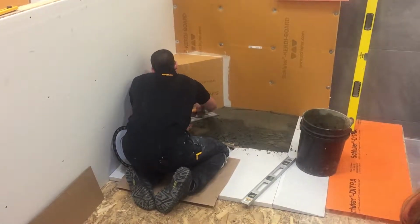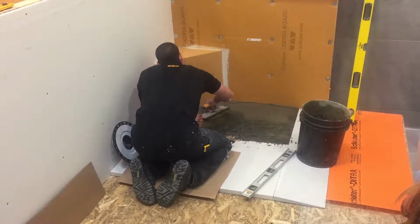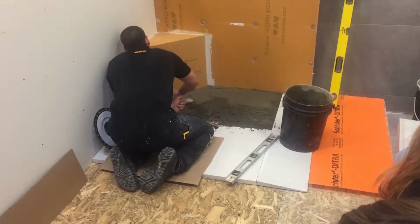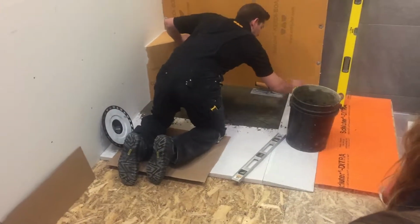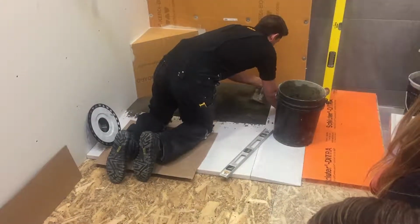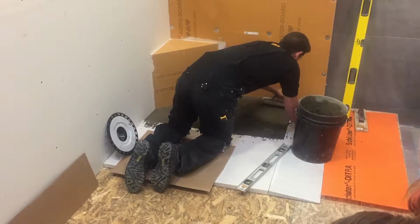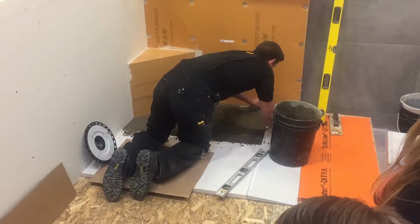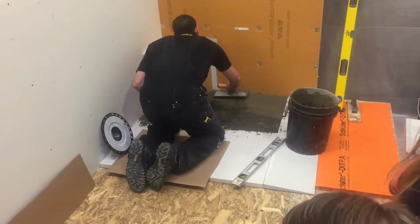Really neat. Use a rotary mixer? Well, there's a few different ways that you can do it. I've seen guys do rototillers. I've seen guys mix it in a bucket like this with a mixer. Not a great method to do that. I'd rather them do a hoe inside of a box. A hoe and a shovel actually works really good. It's just a little labor intensive. And your density on it obviously. Yeah, the mixture with that is generally a 4-to-1 sand to Portland cement mixture. So once that hardens, that's going to be just as hard as most concrete.